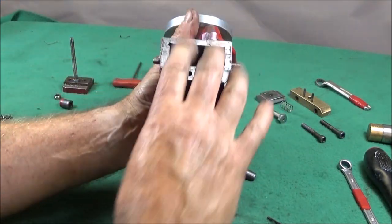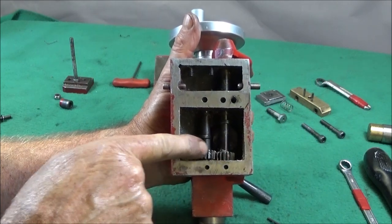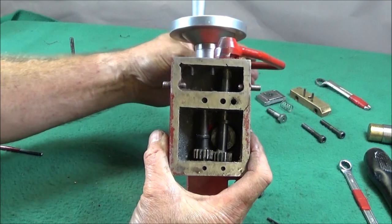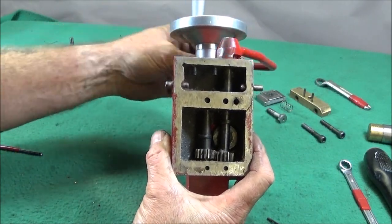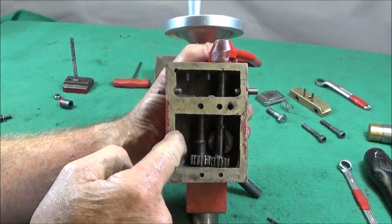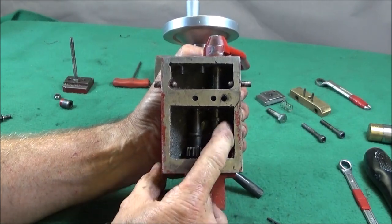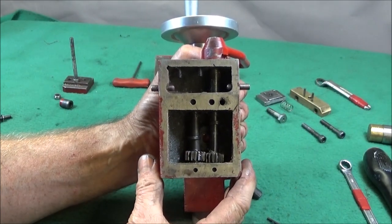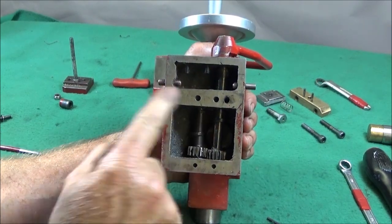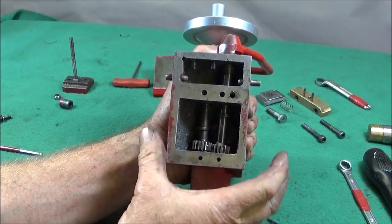In this tailstock you have two camshafts connected by two gears. When the lever is pulled the gear operates both spindles at the same time and the cams move round onto this spacer, lifting it up and pulling the t-bolt up under the ways.